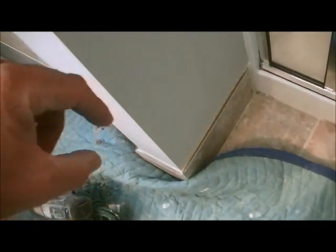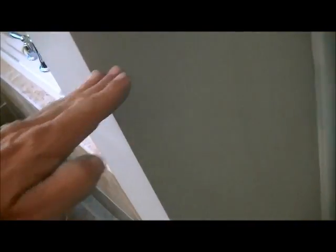What I am going to do is bump it out. It's about three, three and a half feet across by about two, two and a half feet deep. I'm going to get about another foot of depth — roughly three more square feet — by taking this wasted space at the knee wall and bumping it out to the furthest point. That gives me about another three inches to fill in on this wall, and then my curb will go right here.